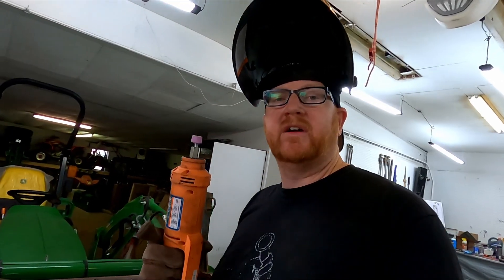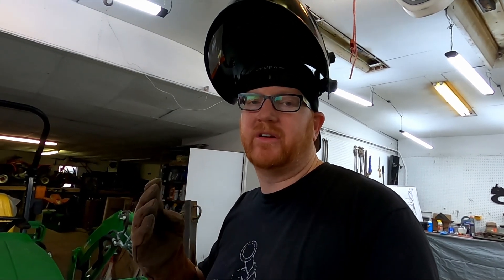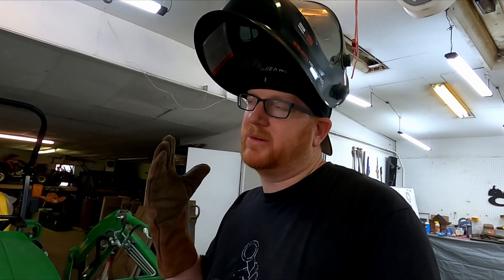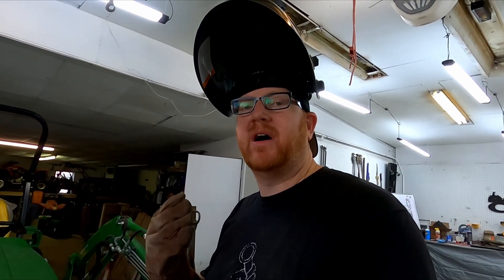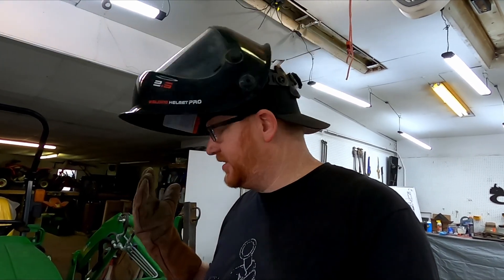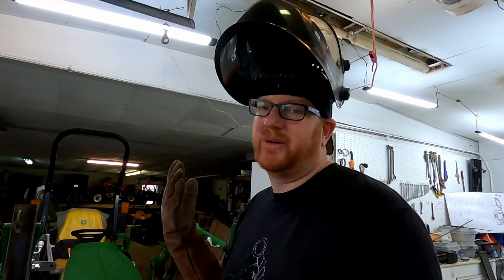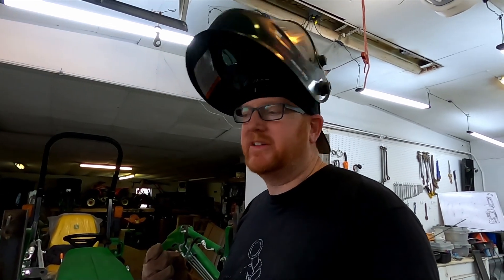I was having to do some grinding on these holes because even though I used a center for my hole saw, it's kind of a used one so I think it has some oval to it — it could have been cutting a little straighter, it had a little walk to it. I probably should have bought a fresh new hole saw for this project, but hey, it's gonna work. I remeasured and centered the hole so my alignment will be good, then I was able to fill the gap with weld, so I think we're gonna be good on this.